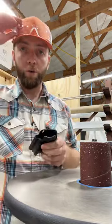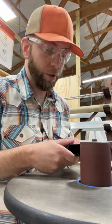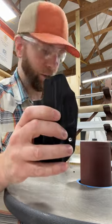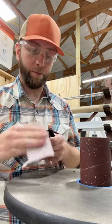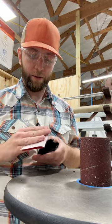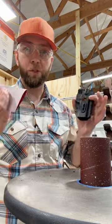Finishing that up, you can use a drum sander if you've got one. Go for a nice straight edge and then round your corners like so. Or if you've got time but you don't have these tools, just take some sandpaper. After you've created your shape, it's pretty easy to just go over it lightly — all you're doing is blending the edges so that they're not sharp. That's all. Just make it functional.